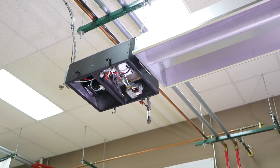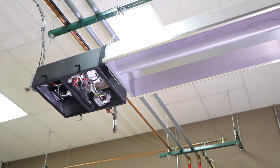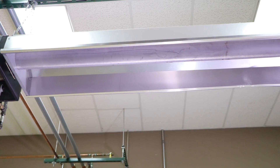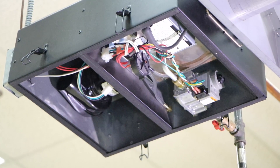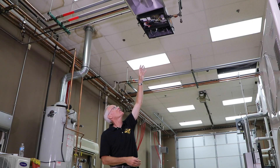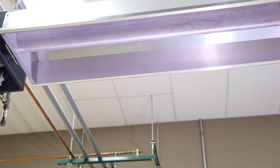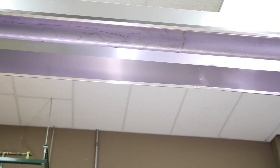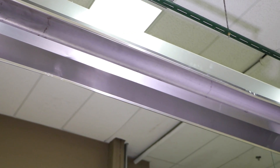This above me here is a working infrared heater. Let me talk a little bit about the components. The tubing you see here is hot rolled steel. The reflectors are aluminum. The burner head contains the inducer, the gas valve, the fan wall control board with a direct spark ignition, a pressure switch, and transformer. This is just like a small furnace with a straight heat exchanger. There's nothing magical about this infrared heater — it's something you've worked on before and it's very easy to install and service.